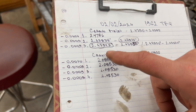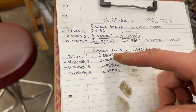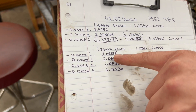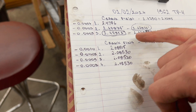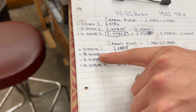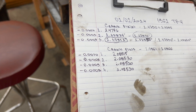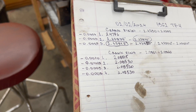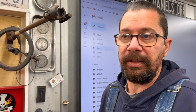Nine ten-thousandths is almost a thou — 0.9 thou. Same for the crank pins: we only wrote down the smallest measurement per pin. His digital micrometer goes to five digits after the decimal — that's a hundred-thousandths — so ignore the fifth digit. The differences are 1 thou, 0.8, 0.9, and 0.8 smaller than spec. So the crankshaft is worn less than one thou. The maximum wear limit is one thou, and up to two thou is not unsafe to drive.